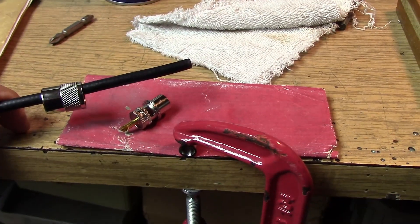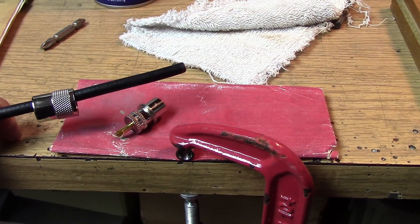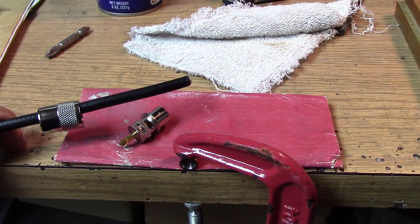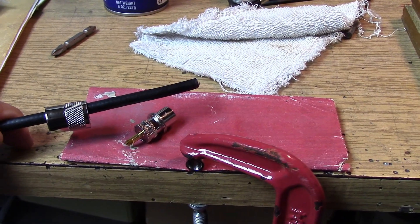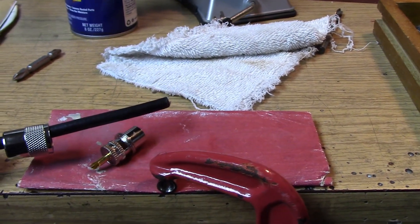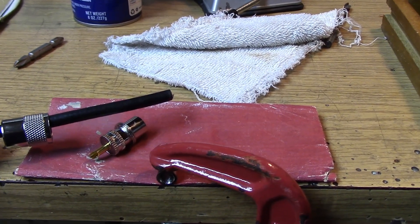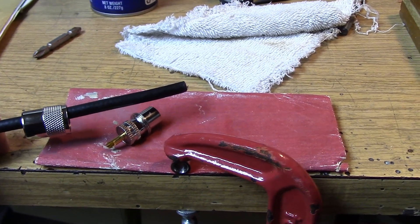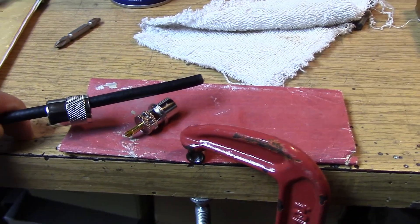You've got to terminate the end of the coax with some type of connector. A BNC specially made for RG6 would be ideal, or you can get PL259 adapters that will fit the cable. They almost always have to be drilled out somehow to actually fit on the cable, because the cable insulator thickness varies so wildly throughout the industry. It would be a rare occurrence if you actually found an adapter that goes into the PL259 that works with the cable.